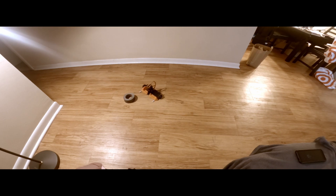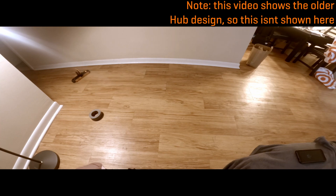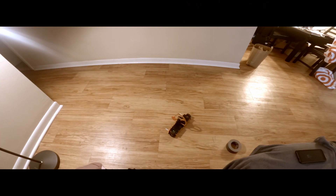While performing these drive tests, I also discovered a weird issue with the hubs, where sometimes after several minutes of driving around fine, one side would just slide off the shaft. I undersized both hubs to 5.9mm diameter so they would press onto the shafts, but it seems like plastic likes to creep under constant stress, so it would be smart to use a dab of hot glue to keep them adhered during a fight. Pressing them on works fairly well for testing though — I was able to drive around for more than 4 minutes before one came off.